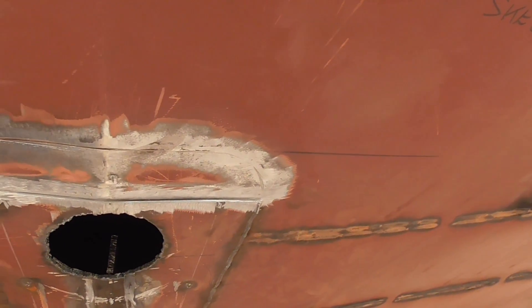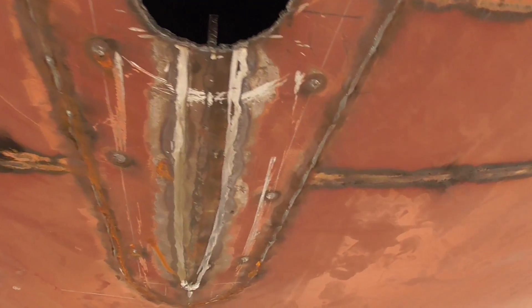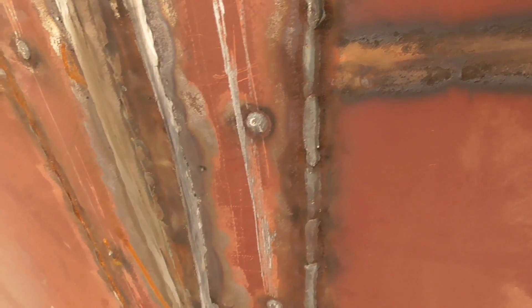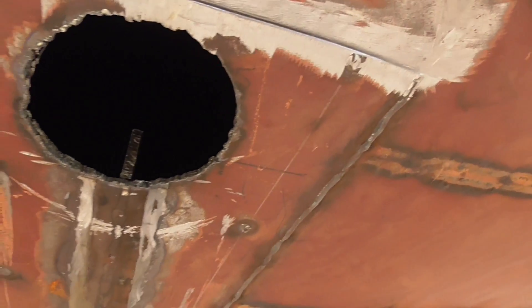You can see I had to cut the doubler away at the back end here, and in that area where I've had to cut the skeg off you can see there's quite a big groove in that doubler plate. It's not too bad — I'll just weld and fill that, then grind it smooth again and clean up this hole.